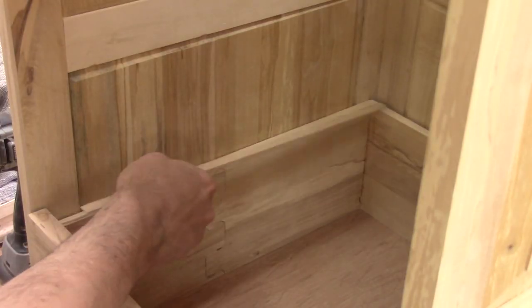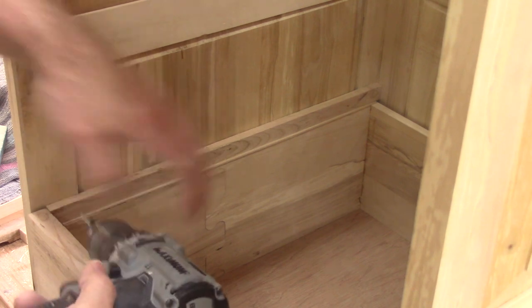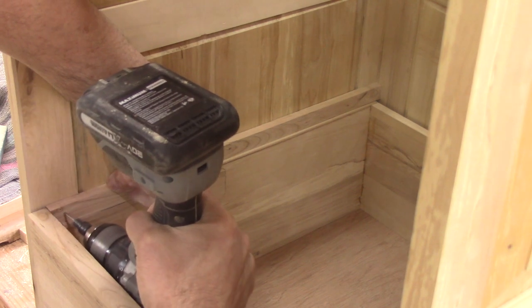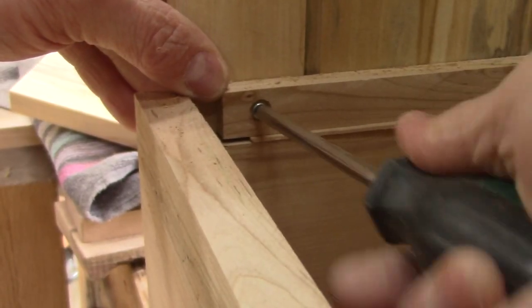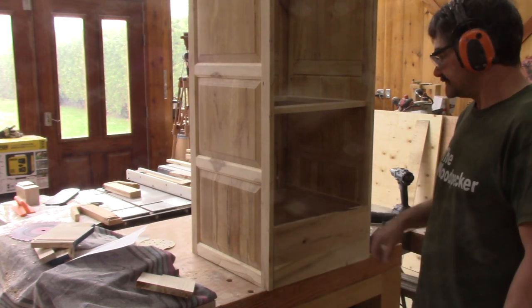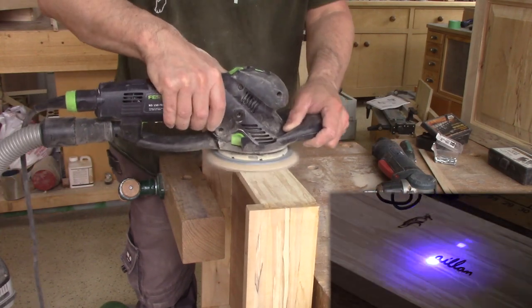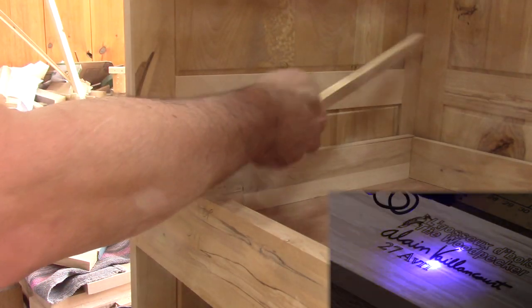Now it's time for the second drawer. To hold it in place, I put a small spacer and the strip that will hold the next drawer on top of the first one. Then I drill two holes and screw the strip in place. When both sides are in place, the bottom drawer stays put and the second has something to slide on. But before working on the next drawer, I laser burn my logo on the side of the first drawer. And while the laser does its job, I work on the second drawer — I need to screw the strips on this one also.